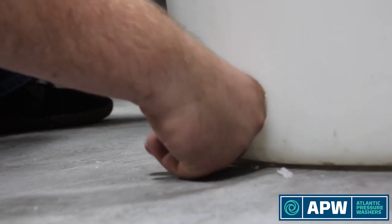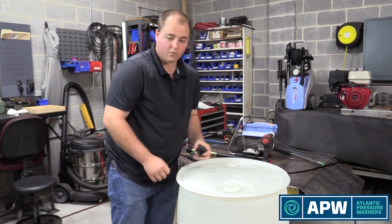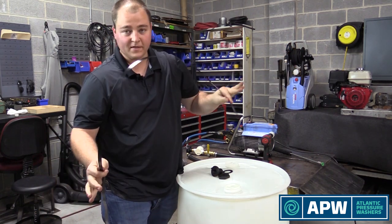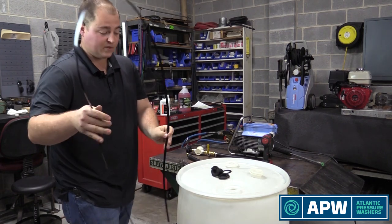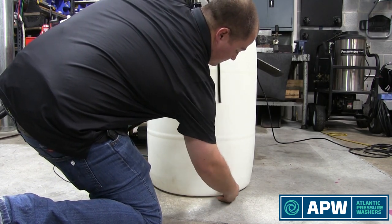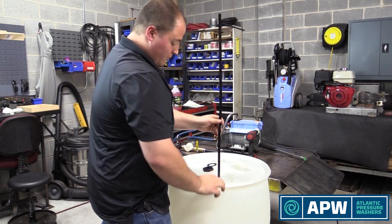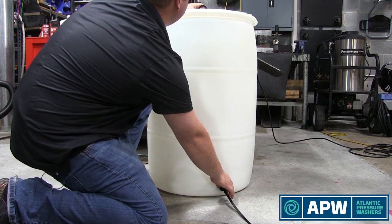What we're about to do is drop our bulkhead fitting through the tank itself. To do that, I'm going to use a very special tool — a random piece of band metal we've got laying around. The reason I'm using this: I can take the top off, I can fit the bulkhead fitting down, but I've got larger hands so it's not going to actually fit through. With the band material I'll basically feed it through, step it down, and pull it through the hole itself. All I need to do is step on this side, make sure you remove the top gasket and the top flange, drop it straight through, kind of wiggle it around, and now it's down there. That way I don't have to worry about anything extra or fitting anything through.